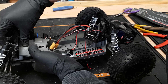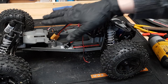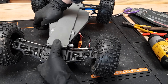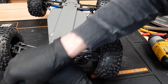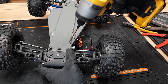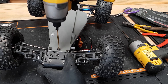Now let's put this back together. A good trick when reassembling: it's always better to leave the screws loose until you've got them all in. It makes lining everything up easier, because if you tighten them and anything doesn't line up you're going to have a harder time. Get all the screws in about halfway, then once they're all in you can go ahead and tighten them all up.